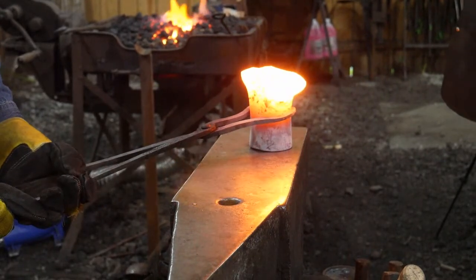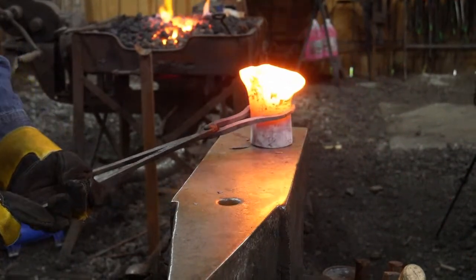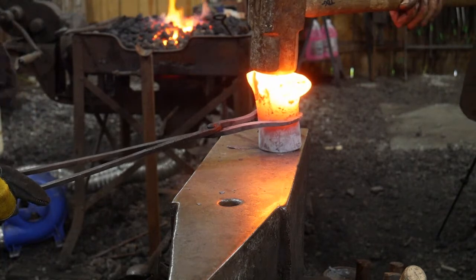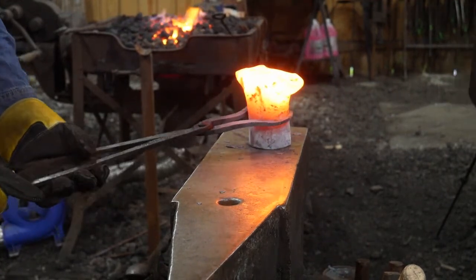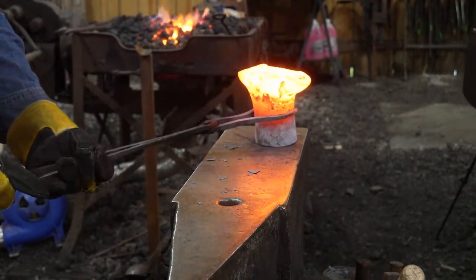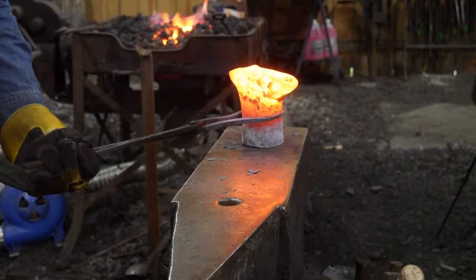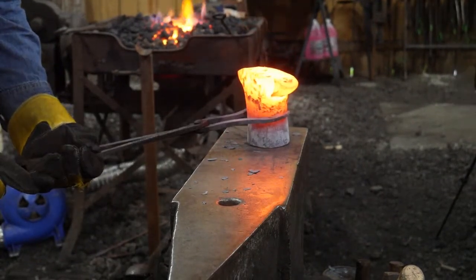Bring up the end of your hammer handle so you hit more square. You're dragging that side. Come down more toe right there. So you've got to pull up on the end of your hammer handle. Now aim for those ridges. Other side. You've got to really work the other side to even it out.